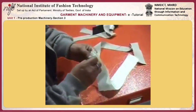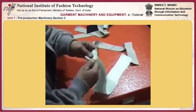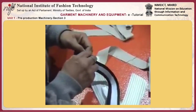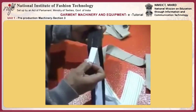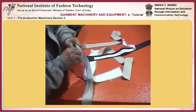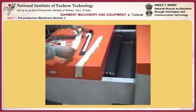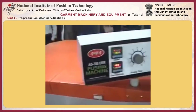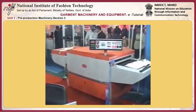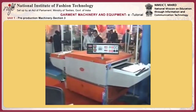It comes out. If you see the peel strength on two interlinings it is perfect — it gives almost 9 kg per centimeter square with 18 bar total pressure. The interlining is getting worn off but it's not coming out. This is the perfect machine for shirts — for double or even three interlinings at one time with no problems. This is the AGFA 700 DRR. Other models are also available with refrigeration and the same technology.